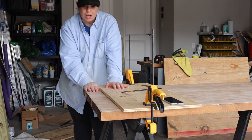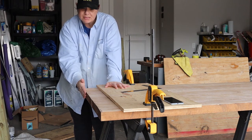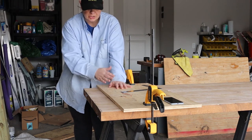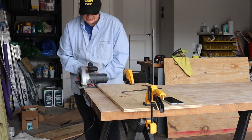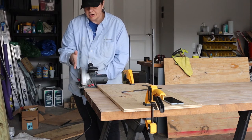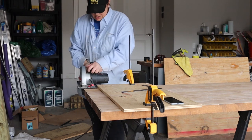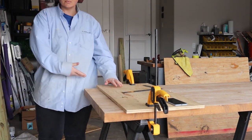What we're going to do to finish this off is cut off the ends of the board to where they're even. I tried my best to align these, but I didn't do a perfect job, so we're just going to chop them off. What I've done is installed a straight edge here at the width of this circular saw. I measured and I know that the blade is right here on this little notch, so I've aligned it to fit right here and it's just going to run straight up against this edge — I don't have to worry about whether or not I'm doing a good straight job. We're just clamping it down, cutting this off, and we should be done with our tabletop. Voila! We are done!